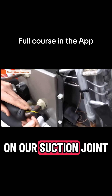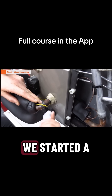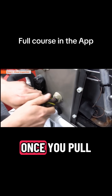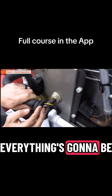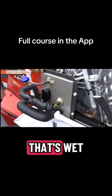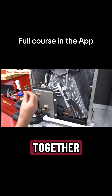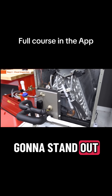Let's say we have a leak on our suction joint. Over time, it was done poorly — the vibration of the system has started a leak. It's pretty easy to see once you pull this back; everything's going to be coated in oil. You're going to be able to feel that. Get used to noticing the difference between something that's wet and actually oily — rub your fingers together, very oily — it's going to stand out.